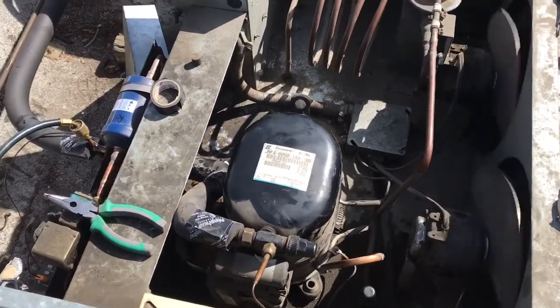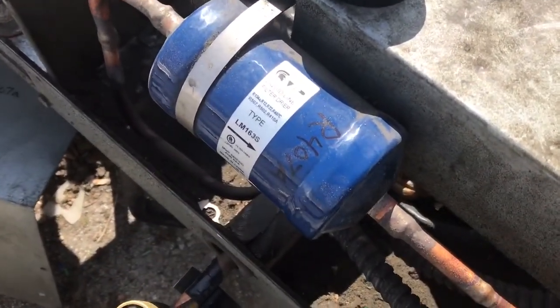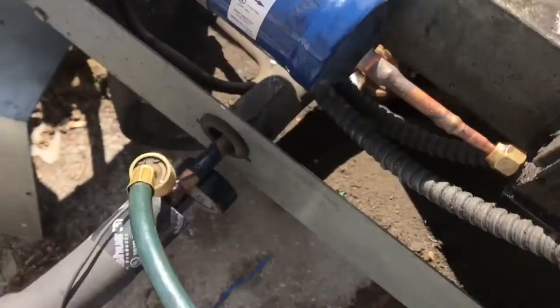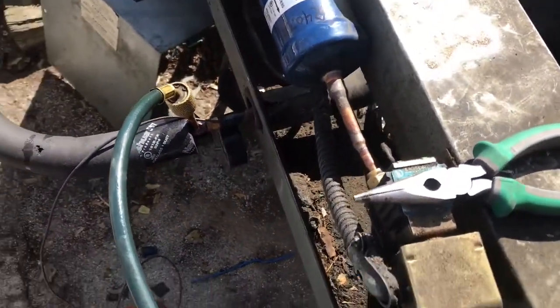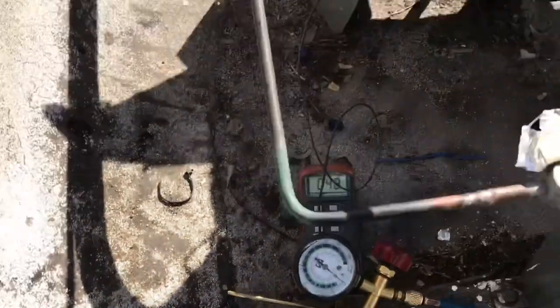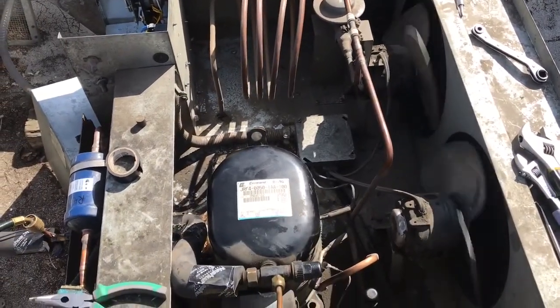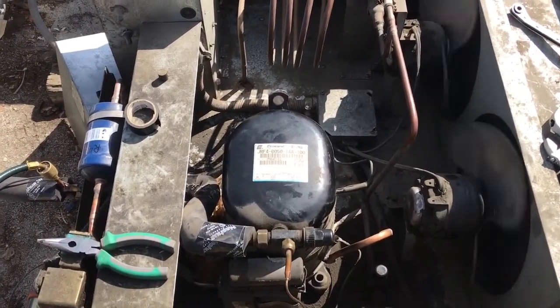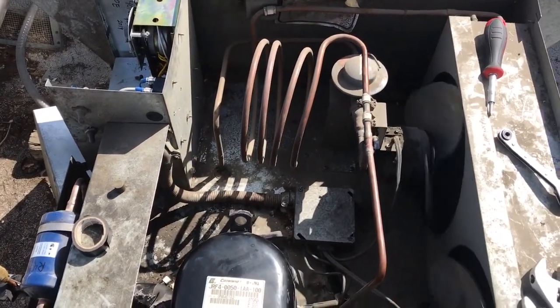The unit's running and it is now going to be on 407A. Everything looks pretty good. Suction is under 40, but it just turned off. The unit is running on 407A now — hopefully no more problems and I won't have to be up here for a long time.